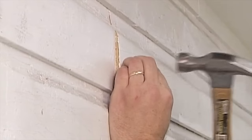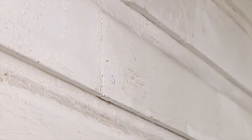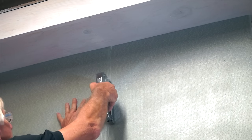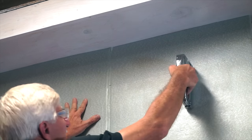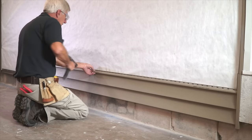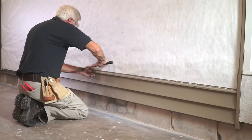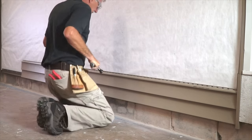In most re-siding projects, panels are attached to existing wood siding. To prepare the walls, nail down any loose boards and replace all rotten wood. Using foam backer board to level the wall surface is suggested. For all projects, remove protrusions, such as gutters and light fixtures. Before you apply anything to the walls, let's review fastener choices, fastening techniques, and tools.